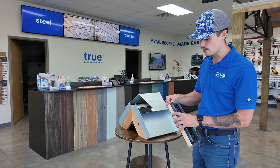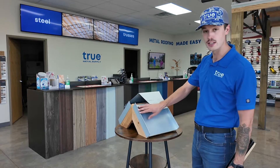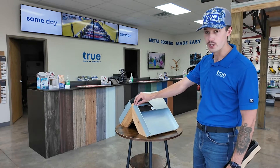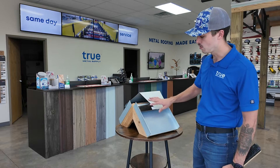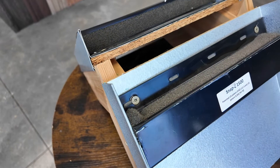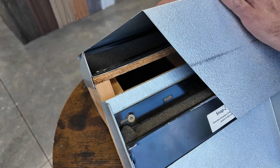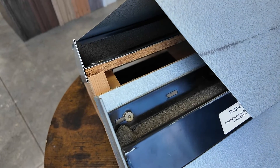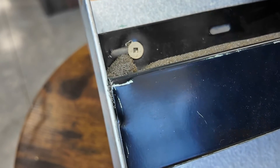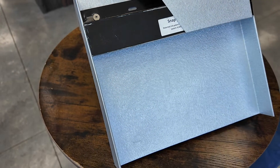To install these, all you have to do is pull the foam out just a little bit from the edge so it completely closes in the gap between the Z channel and the rib of your standing seam panel, just like you see here. Get up close and you'll see how the Z channel looks once installed at the ridge — the pancake screw is installed right in that slot, with butyl tape already applied. Very simple solution to venting your standing seam metal roofing system.